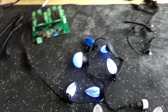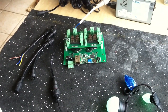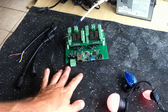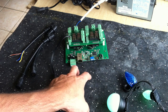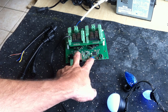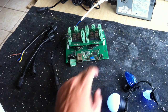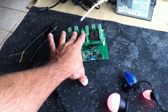The next thing I want to talk about is what is running these. If any of you have followed the Joshua line and what Ed with J1S has been doing, this is the new P12S controller. It's really cool — a little bit deeper on the board, but the connections are identical to the P12R. The main change is that there are now two processors on this board instead of one. The P12R was limited to 12 outputs and 12 universes based on what that single processor could handle effectively. By splitting it into two separate processors, that gives us the ability for multiple universes per pixel output at some point in the future.